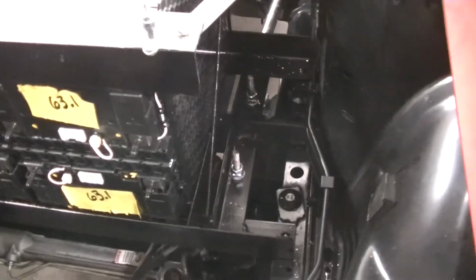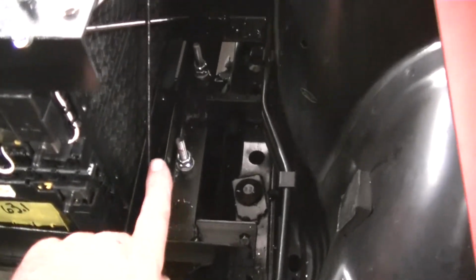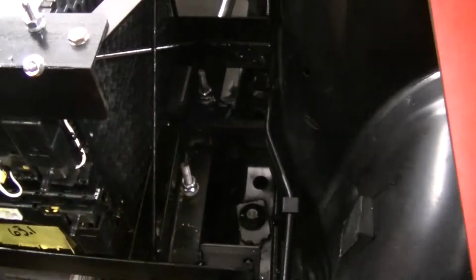So what I have there, that's double nuts. I double nutted it so it has the locking feature like jam nuts. Then underneath there, I have a, zoom this back out. And underneath the plate is a nut coming up. Since it was a threaded rod, I was able to go up underneath, so I was able to clamp everything really tight. So everything's tight, double nutted there. This thing is solid, it's not going anywhere.